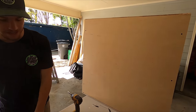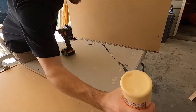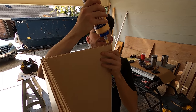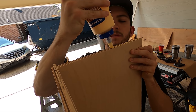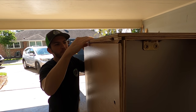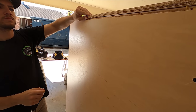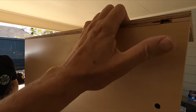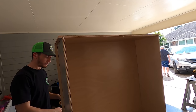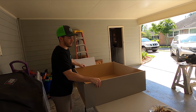We're going to put our glue in this little groove here, then run it along the top of the sides. This plywood is porous, so we just go around the edges. There's actually a little piece of wood in the way here — I'll pull that off. Now we'll put the clips on and put it back on its back. We're ready for the face frame.